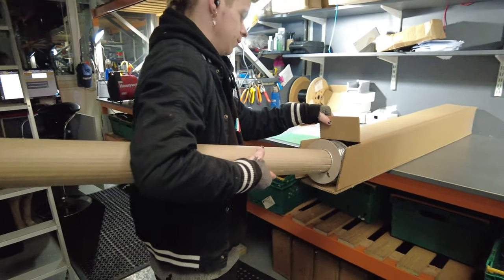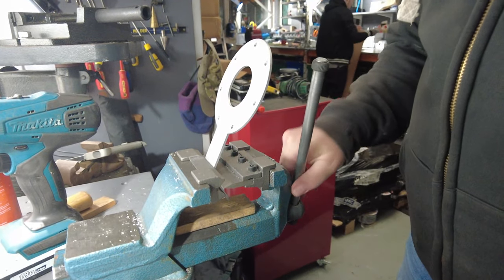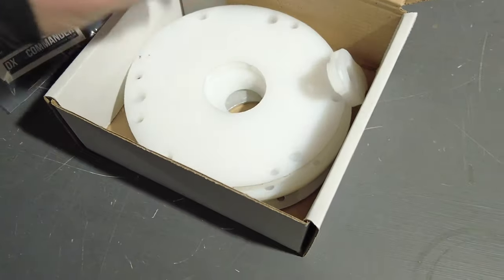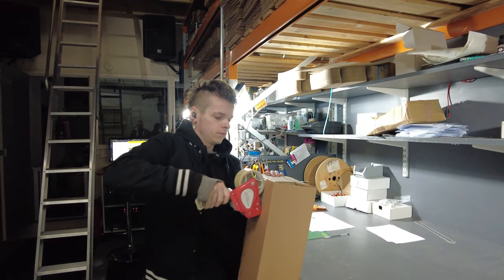What's in the box? Loki wraps corrugated cardboard around the pole and slides it inside a heavy box along with the wire. We also get the pre-drilled, tapped aluminium plates — the tab is already bent up to accept the SO-239 that's supplied. You also get the ultra-high-molecular-weight polyethylene (UHMWPE) plastic plates, which are the guides for the elements and also used for guying. Wandy packs the nuts, bolts, and washers, and you get a few spares as well.